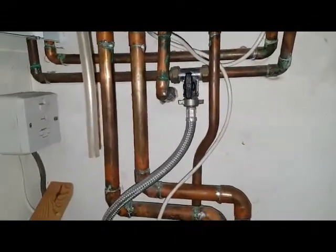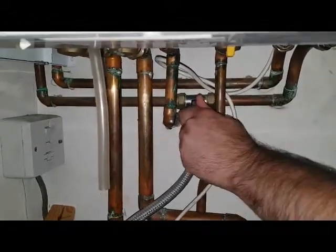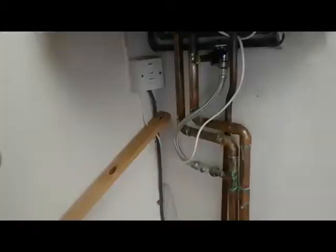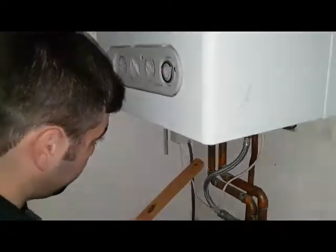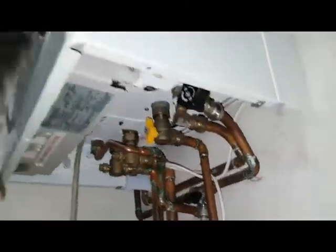So we'll turn that off. Turn it off, Gillen, and then we're going to drain it down and repressurise the expansion vessel. So Gillen, if you look on that switch at the bottom, just turn the isolation switch off. Okay. Alright, to undo the case, there shouldn't be very many screws on there. That should just lift off then, basically.